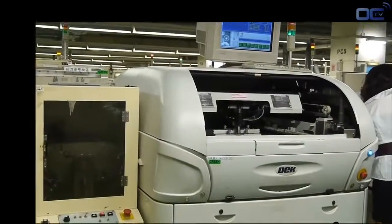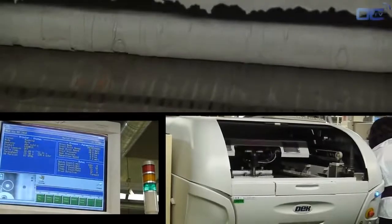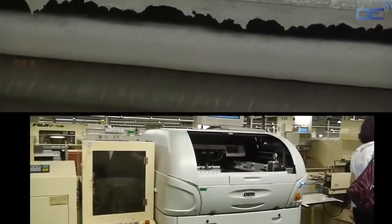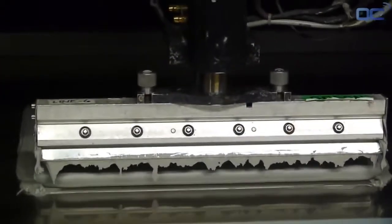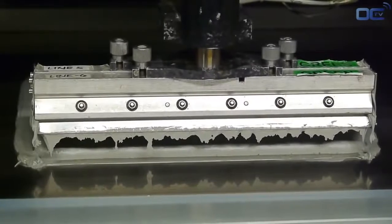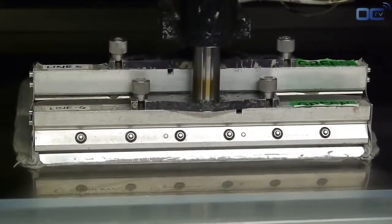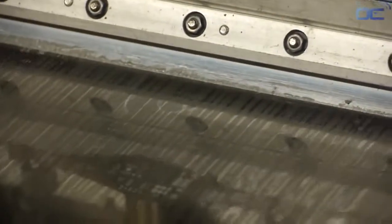Every part of the PCB that will be in electrical contact with the component gets a special soldering paste. The solder paste acts like a glue for all these chips before going to the reflow oven for definitive soldering. In that way, every small component can stay in the right position before soldering. As you can see, solder paste is applied to only the PCB space where you will have a component.